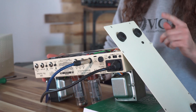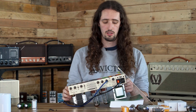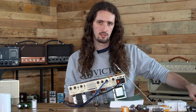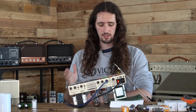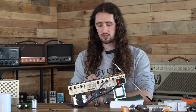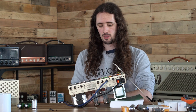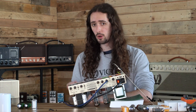Make sure it's set to standby on the front panel and switch on. Give it a couple of minutes just to get warm. Now that your amplifier is switched on and set to the high power mode, make sure all of the controls are turned down to zero and any switches are set to their off position or to their upward position.